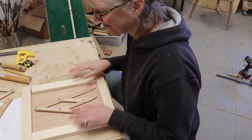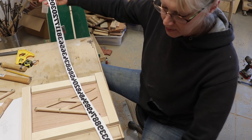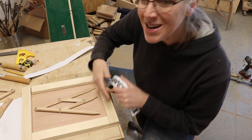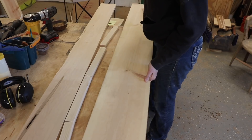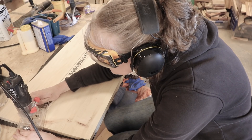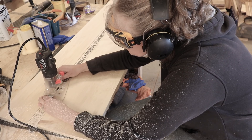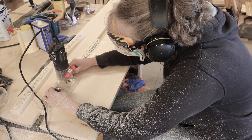I printed off part of the Fibonacci number — since it goes to infinity — and thought it'd be fun to put the numbers on the frame. I set out the boards, put larger boards around them, used the lacquer thinner transfer technique to move the numbers to the wood, and then routed out the numbers. I used a 1/8-inch spiral up-cut bit and routed out the numbers to the 56th decimal place.